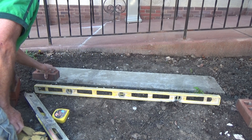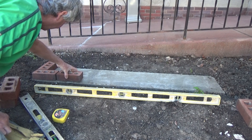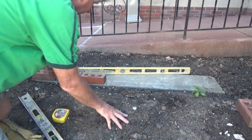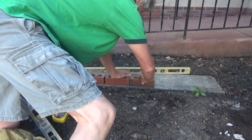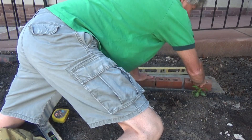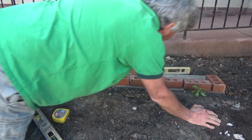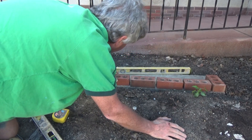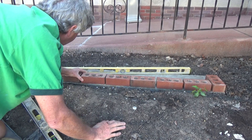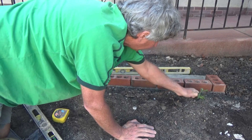Any time you are going to do brick work, I know they make rulers and everything, but the old timers would always make me lay it out dry. Why? Because every brick might be a little different size, and rulers sometimes can make mistakes. When you lay it out dry, you look at it, then you can adjust all your joints the way you want them to come out so they're all even. That's why you lay it out dry — just like tile work, you don't make a mistake. Then you know how big you want your joints. That's how big I want my joints.